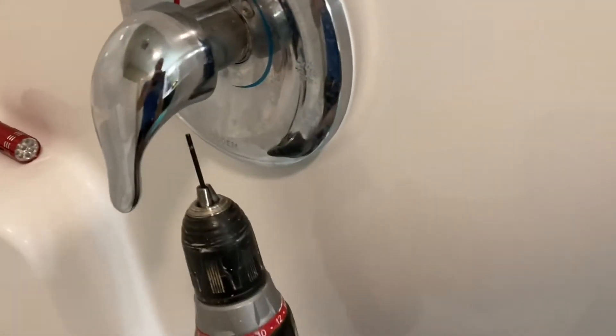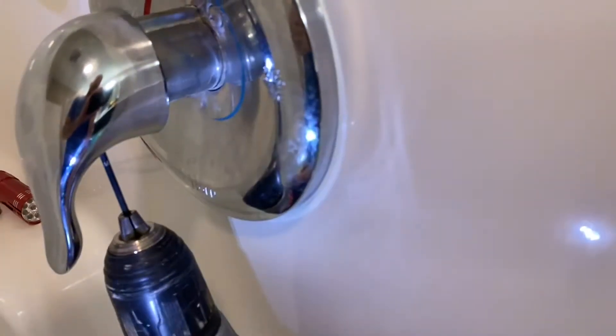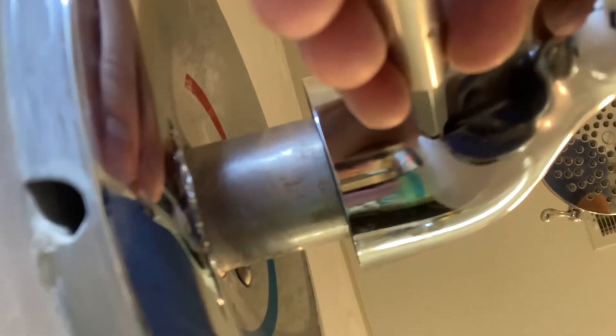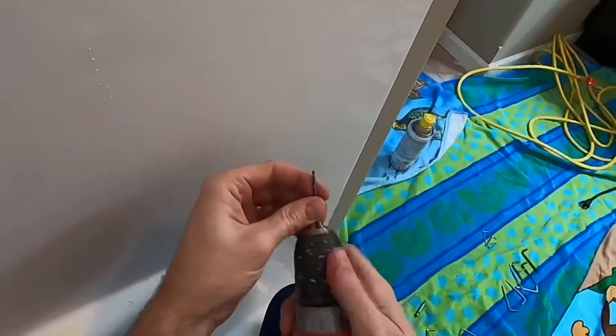If that doesn't work and you feel like it's stripped out or getting to that point, you might want to cut off the end of your allen wrench with a hacksaw and put it into your drill — that way you can provide a little more pressure. I didn't have to turn off the water for this removal, but you might have to, so be careful. To remove the trim piece I did not have to shut off the water. Since I couldn't get that hex screw out, next I'm going to take a phillips head screwdriver and put it in there very gently, give it a few taps. Look how I'm positioning and supporting the handle — if you don't support it and just hit it with the hammer, you might damage the internal parts of your valve, so be really careful.